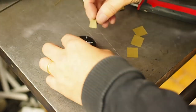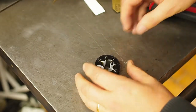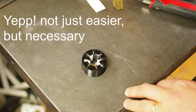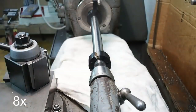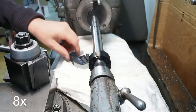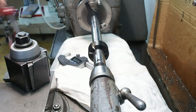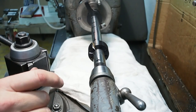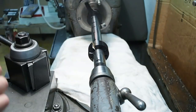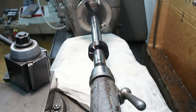Starting off with 600 grit sandpaper. The hard part is getting it started on there — might have been easier to have mounted the lap onto the end of the bar first. The use of 600 grit sandpaper has already taken out all of the machining marks. So the next task is going to be trying to bring this down to a nice even dimension — we've got a little bit of a lump here and a little bit of a lump through here. I'll do one more pass with the 600 grit and then start looking at dropping down to finer grits.